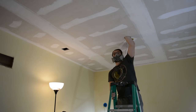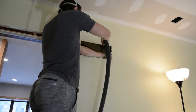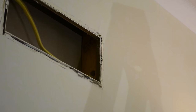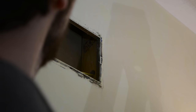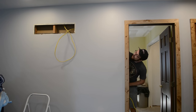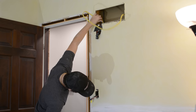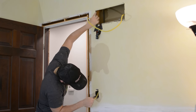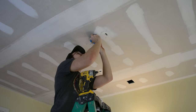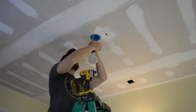Now that we have the wire fed through the ceiling, it's time to go through the wall. I just had to cut through about two studs, and I used these HVAC returns as access points to do so. I attached a headlamp up here to provide a little bit of light so I can see better as I feed this. I then installed the old workbox in the ceiling, done in a similar fashion to the ones I already did on the wall, and then I hooked up another light just to make sure that everything was working properly.